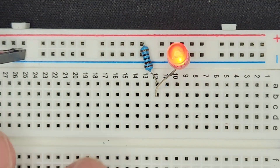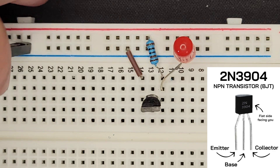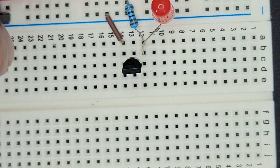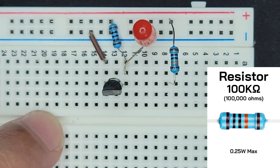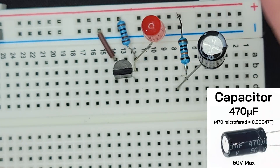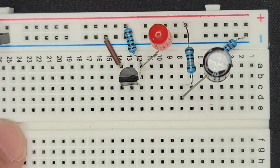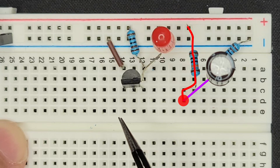This should turn on when we plug it in. What we need to do is basically add a transistor. Ground the transistor, and then for the base itself we're going to put the capacitor in parallel with the power supply, with a resistor pulling up from the power. I'm going to use a 100,000 ohm resistor to really slow down the charging of the capacitor, and then in parallel connect it to the base of the transistor and to our capacitor. I'm going to add a small 1000 ohm pull-down resistor to the capacitor, and then connect this junction to the base so the current can go through the capacitor or into the base.